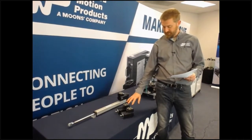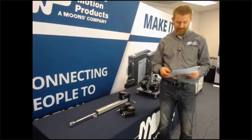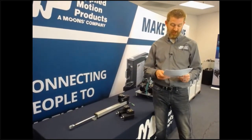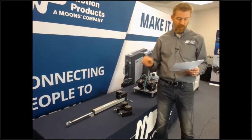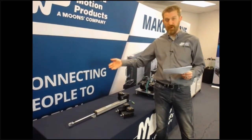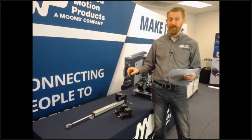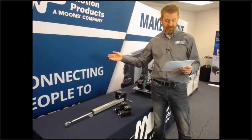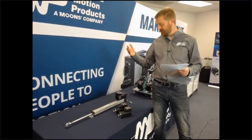So we have these two step-servo motors here — one with absolute encoder, one with incremental encoder. They're really pretty similar mechanically, but once we get under the hood, the differences really start to pop up. One of the major areas where you want to minimize wasted time is in machine startup. From the moment you turn on the machine until the moment the product starts flowing, you're wasting time. The TrueCount encoder eliminates homing from your machine startup process completely. The encoder can keep track of its position relative to a predefined home location across tens of thousands of revolutions, which moves homing into machine commissioning as a one-time step instead of machine startup as an every-time step.